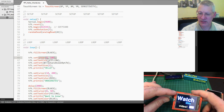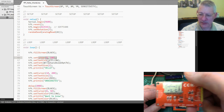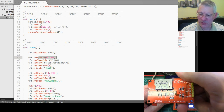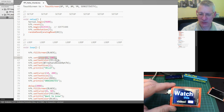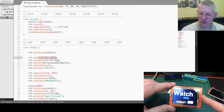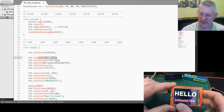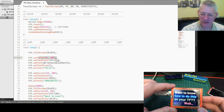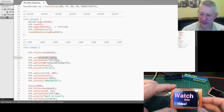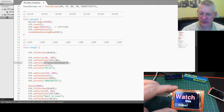Next is rotation — I've set it to 3, which is 270 degrees. I'm picking a random number just for this purpose since I'm picking random colors too. To clear the screen there's no actual 'clear screen' command — what you do is fill it with a black color. The cursor placement is a bit hit and miss; there may be a program out there to generate button placement parameters for you, but I haven't looked for one. You set your cursor — remembering zero is top left — on a 240 by 320 pixel display.